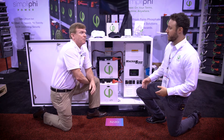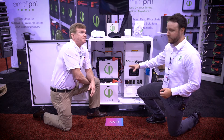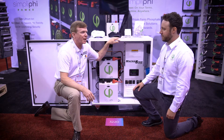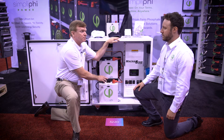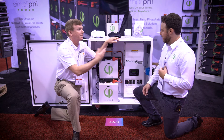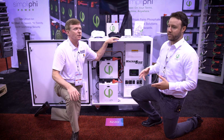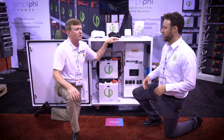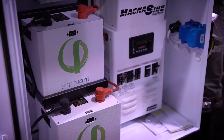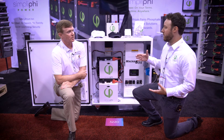These are 24-volt batteries, and 2 kilowatts, as you mentioned, is a great size for this battery bank for this unit. In comparison to a traditional lead-acid battery, I can discharge these much deeper, which is really important for an emergency response situation. With lithium-iron phosphate batteries, we can actually discharge up to 100% depth of discharge, so we can utilize more of the energy storage within the battery — definitely important for something like emergency response, or really any application where you need that availability of energy storage.